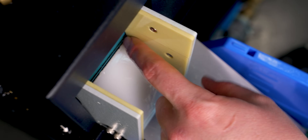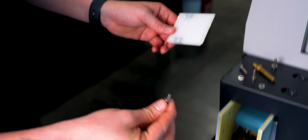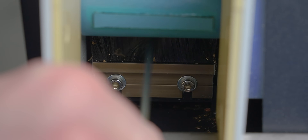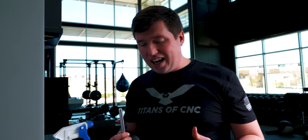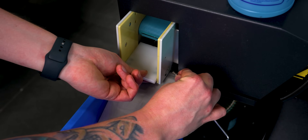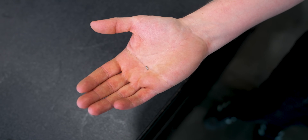Another thing you're going to see is your parts finding their way into little crevices, like down in the corners here. If you look below the belt on this machine, you can see Tornos has a secondary scraper — any part that gets through everything and is still stuck to the belt, this is going to scrape it off and keep it right there for you to find. Got to give it to Tornos, that's actually a pretty good design. It's kind of the worst part about running really small parts in a normal size machine — you're going to have to take this little plate off and dig for some parts.